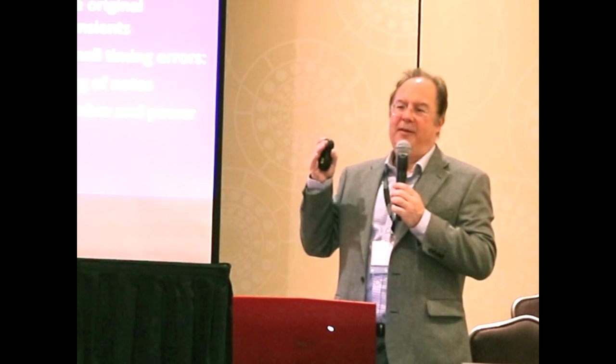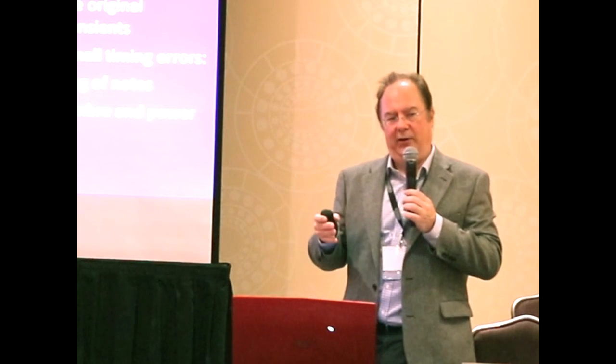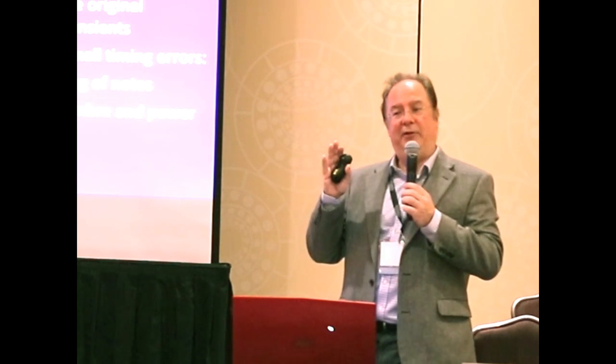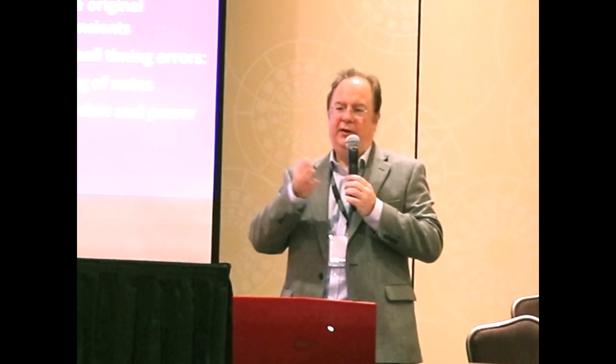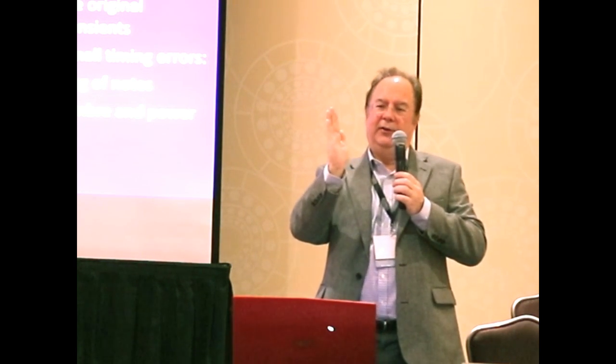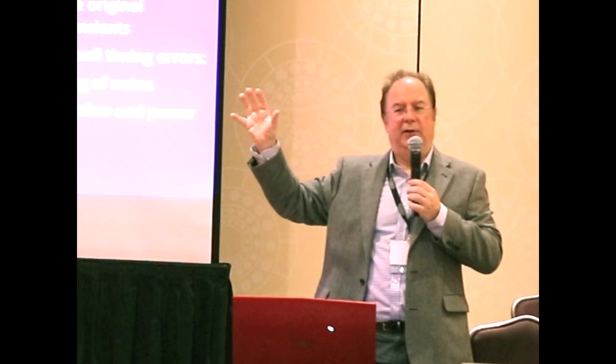And unfortunately, the ear and the brain is extremely sensitive to transient errors, or timing errors, non-linear timing errors, because these are errors that constantly change. So you can have, with a transient, where the signal suddenly changes state, and what will happen with a regular DAC is that the timing of that changing state will either be slightly in front of where it should be, or it will be slightly behind of where it should be. And it will vary depending upon the previous data, and it will vary depending on where the sampling position was on that.